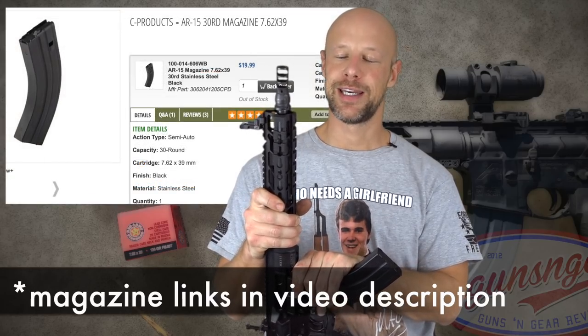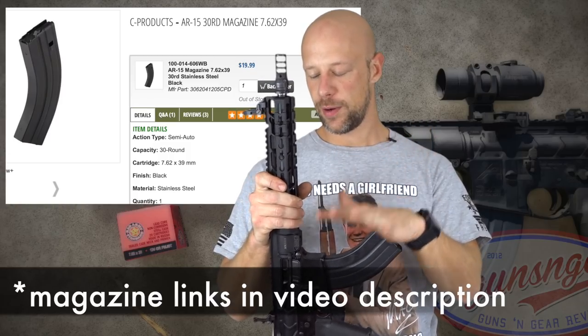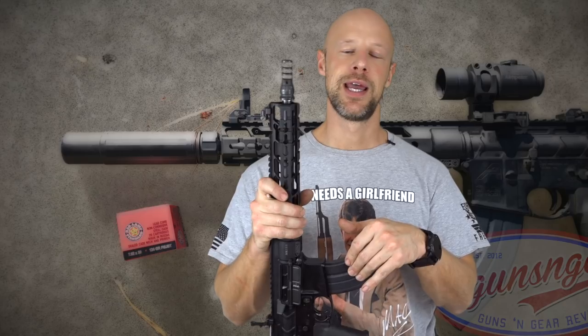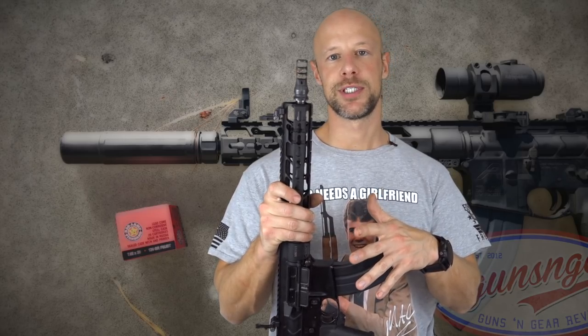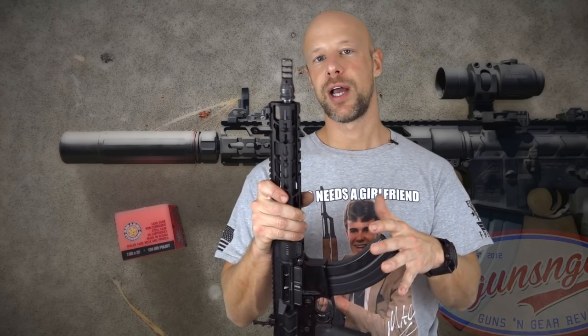7.62x39, and story time here with Mr. Guns and Gear. He was telling me that during the development of that project, the biggest issue they found was magazines in terms of reliability. They could get their upper to function reliably, but getting magazines to feed the 7.62x39 tapered round into an AR-style chamber reliably was not exactly easy, at least at that time.